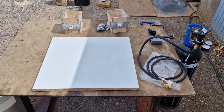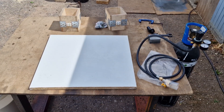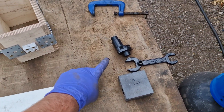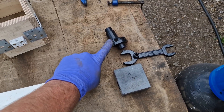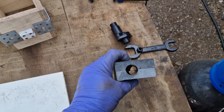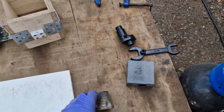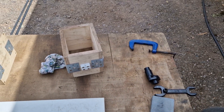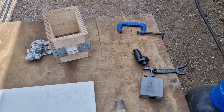So here we go — here's the tools and bits and pieces we're going to need to make up the new housing. We've got the patterns for the outside shape of the casting. This item here is for the core box — this will create the passage down through the middle when it's cast. And then these are the boxes that the outer pattern will be put in, and over there is the furnace which we'll be using to melt the aluminium.